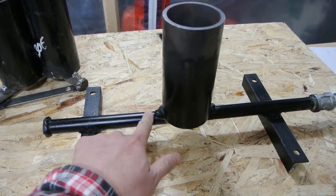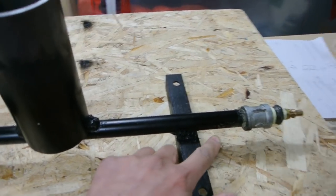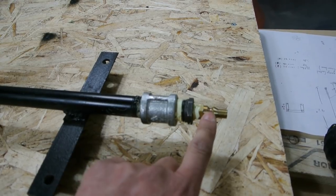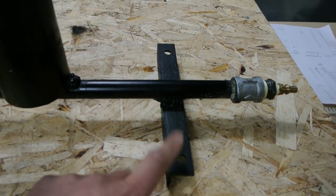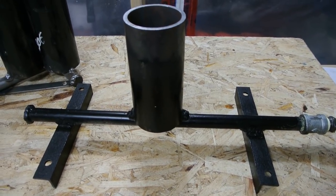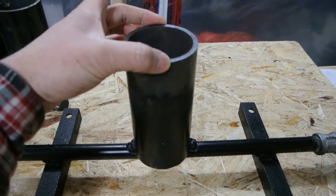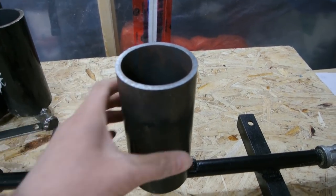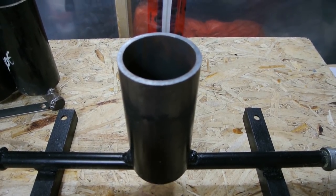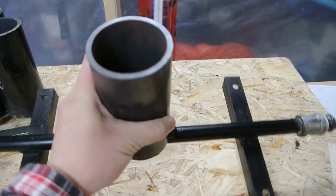So what I did is I got a piece of half-inch iron pipe and welded the end closed — it came threaded on one side. I have a coupler, a reducer bushing, and a quick release to feed propane. Then I welded on some angle iron and drilled holes on both sides for the feet and mounting. One piece of schedule 40 pipe, six inches tall by approximately two and a half inches inner diameter, with a 1.3-millimeter hole drilled at the very bottom for the orifice. And that's the burner.